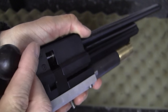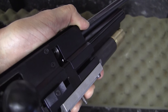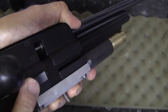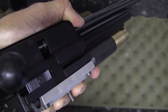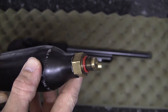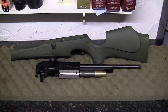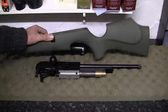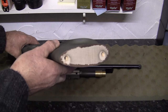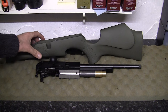If you look carefully into the breech, you'll see that the end of the barrel is silver. John shortens the barrels from the breech end instead of the muzzle end, and then refinishes them and recuts the transfer port. John also does a bit of work on the buddy bottles to match the blueprinting on the rifle, and he fits the little red o-rings on them which he says he's found to be the best he's ever used. But he said the threads in my bottle were showing signs of wear and it would be a good idea to buy a new bottle. I also picked up a second-hand Mark III Beech Super 10 stock.